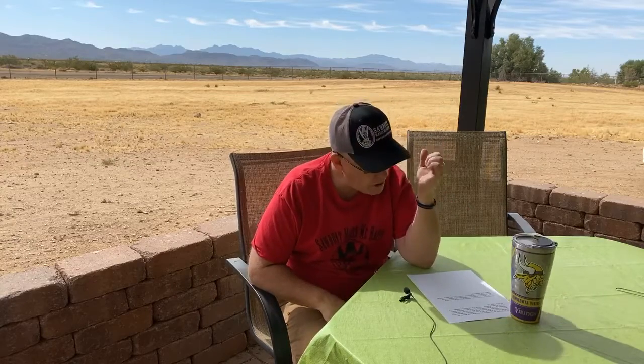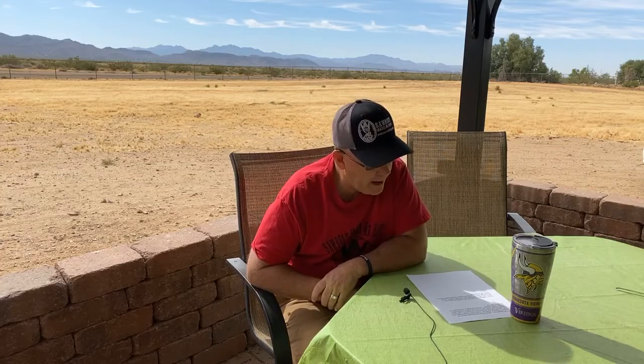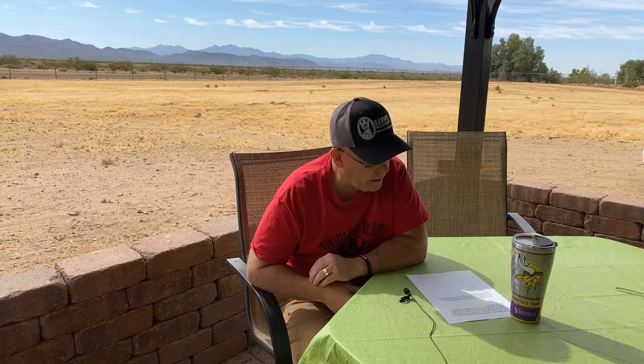So first question I have is from Richie from New Zealand. He says, the 90-degree bit I used for the background wasn't as good as I hoped it would be. It has quite a wide blade on it, and I couldn't get the results that you show. So I went straight up and down, trying to get the dimple effect that you use. So what he means by that is, and I didn't know this till probably about 10 or 15 years ago, all 90-degree bits, just because it says it's a 90-degree angle, a quarter-inch shank, that doesn't mean it's the same as the ones that we use.